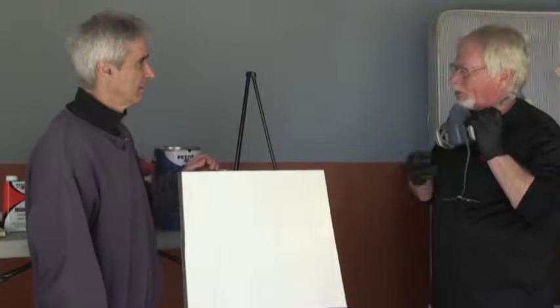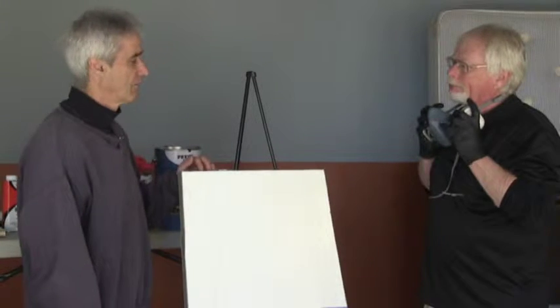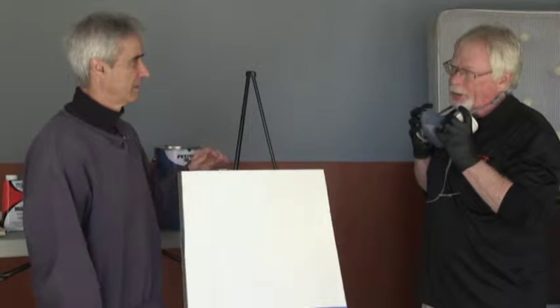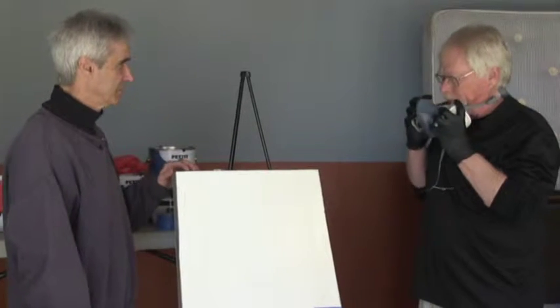220. Wet-dry paper can be used or a regular production paper. I've got a little sticky disc on a hand sanding block, but it's 220 grit. If you get coarse grit on there, it's going to show the scratch marks through the thinly applied polyurethanes. So go with the 220.